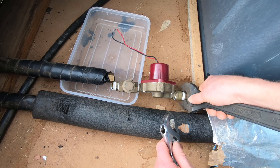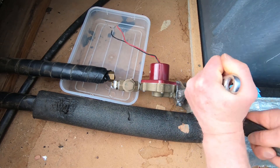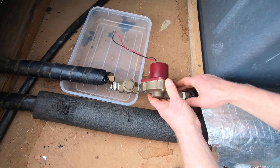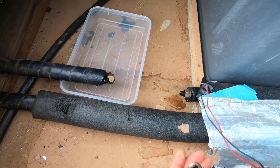I've got a couple of ideas how to improve that. You can now get electronic controllers that measure the temperature and only pump according to the temperature. You do need an electronic controller if you're in an area where the pipes freeze, because it will circulate the water when it's cold and keep the pipes a little warmer to stop them freezing. More of an issue for us is that it can circulate even when it's not very hot, which in winter can actually cool the hot water tank rather than warm it.